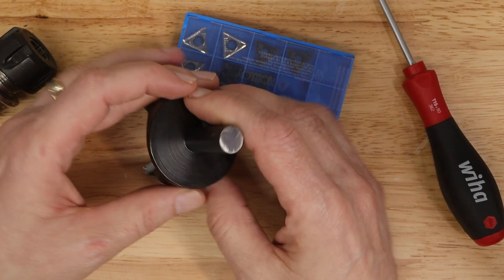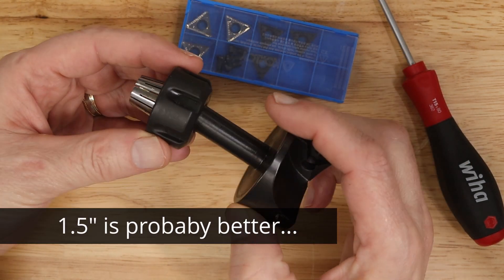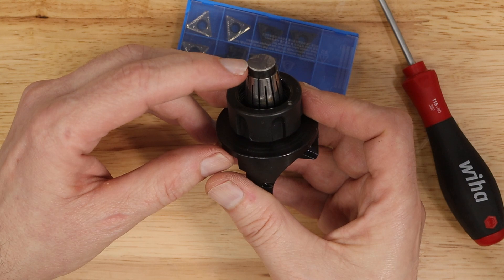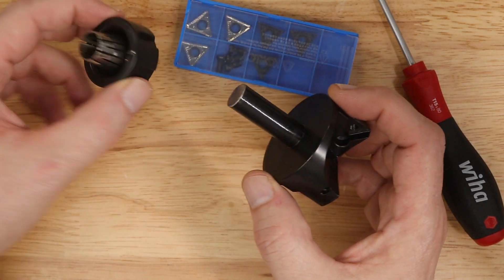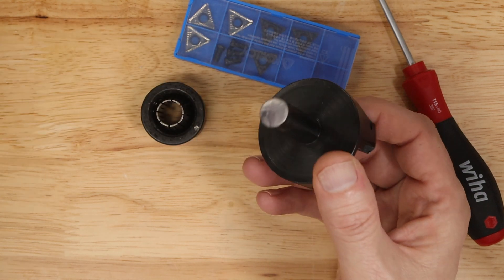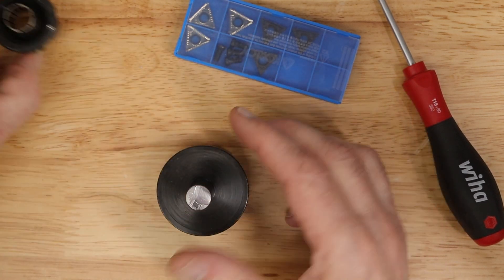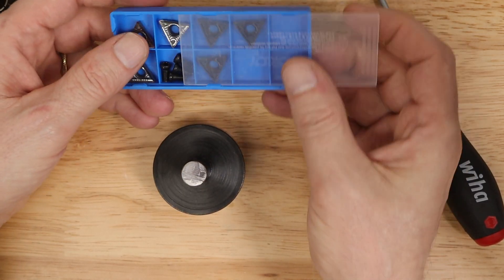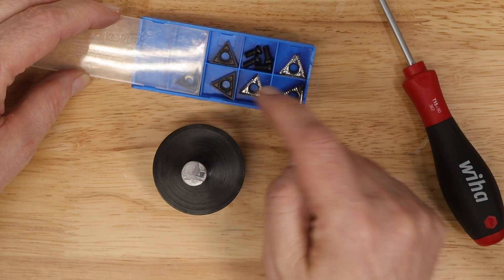I subsequently suggested to him that a length of 1.25 inches was probably just about right. If we take a look at the ER20 collet, you can see that this sticks out about a quarter of an inch, so there isn't much advantage of making this too long. I have it at 1.4 inches right now — I didn't cut it at exactly 1.5 inches, it just needed to be shorter. Along with the 2-inch arbor, he sent along these inserts and screws. The inserts are for aluminum — the shiny ones — and then for steel, the other.